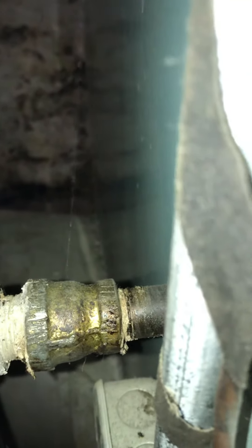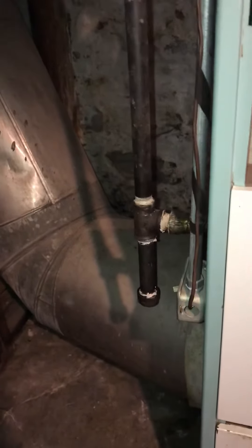We'll make a transition into a new media cabinet. As far as gas is concerned, not seeing an isolating valve, so we'll make sure to include one for the new furnace. We'll shut this one off back at the meter. Electrics are in conduit, so that's good.